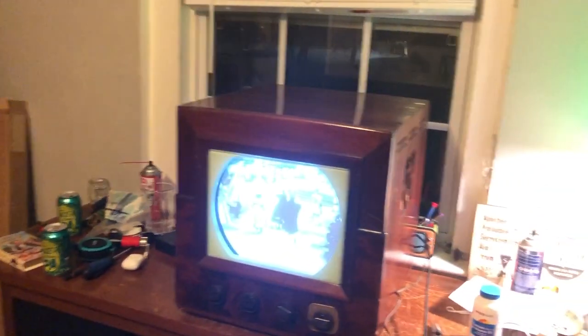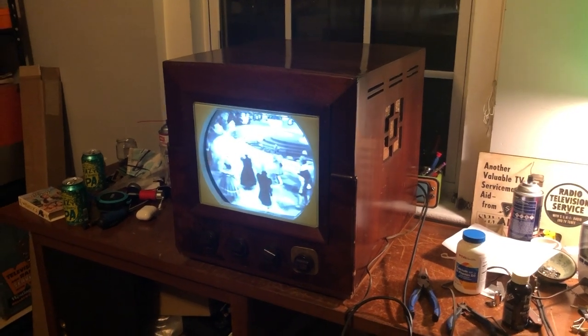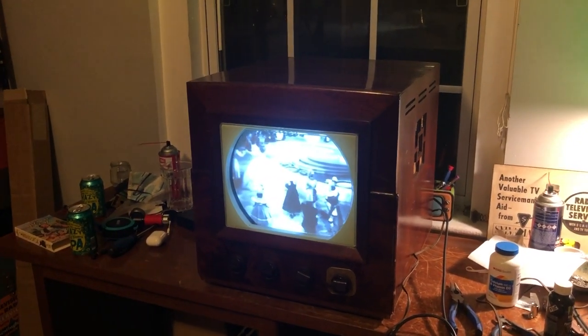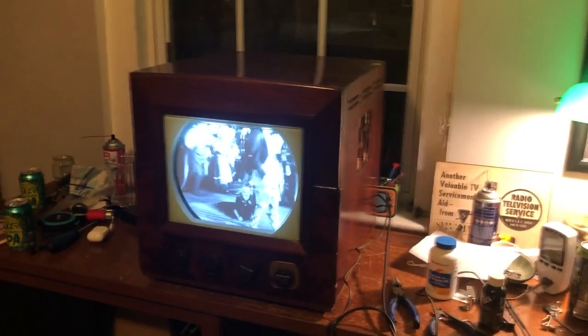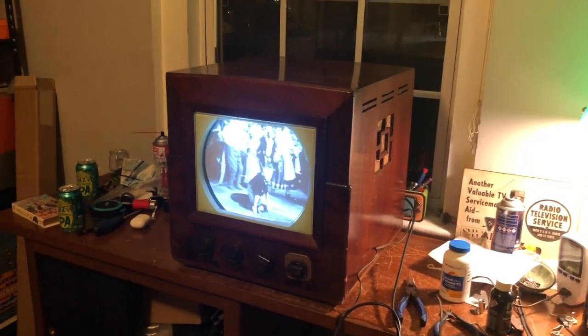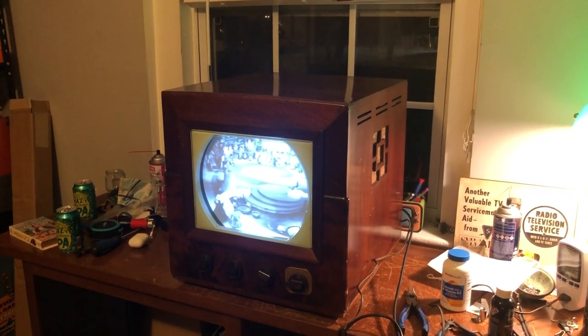This was just a quick video getting high voltage back on a restored set. Some things to watch out for: loose solder connections if it was working before — just look around the high voltage area. Good news, the fix was simple and the set is back up and running.